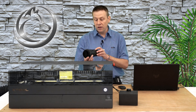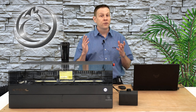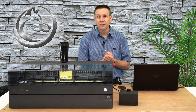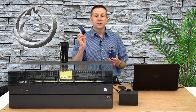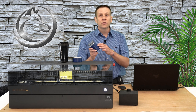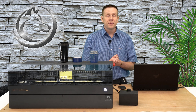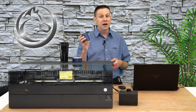It's pretty neat that all the text turned out in the correct orientation. If you're struggling with your projects, here's a tip: rather than practicing with an expensive tumbler just to figure out the correct orientation, I like to save an old jam jar, wrap some blue painter's tape around it, and use relatively low power levels just to scorch or etch the tape. This way, I can keep practicing my rotary setup, measuring the circumference, and making sure my graphics are oriented correctly so they show up the way I want on my material.